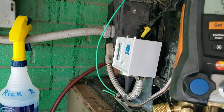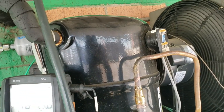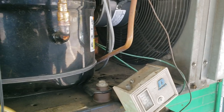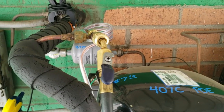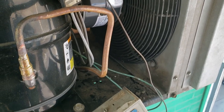Basically we had a leak on the low pressure control. It's an unidentified refrigerant — it has POE oil but it's not marked. The cooler is very old, so at this point it already had the POE oil in it anyway, and you're just converting it. That way it's cheaper than R22 for the customer, and everybody wins.